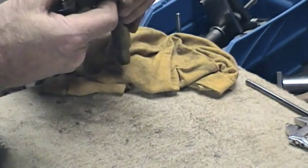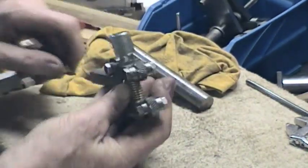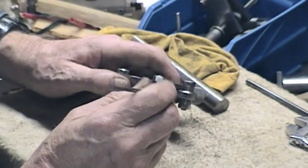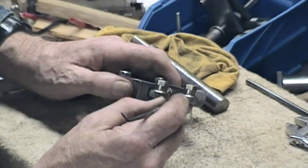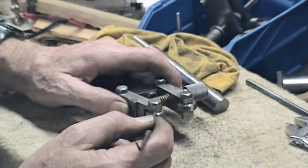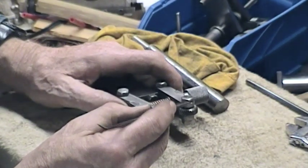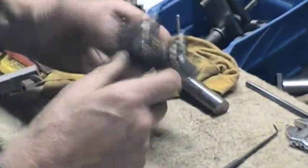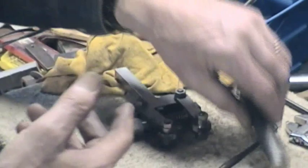So that would now be about the depth of the cutting phase. Now these wheels actually last for a long time when in use. These are bolts, so the wheels - which are hardened - are bearing on softer bolts. But we flood this with oil, plenty of oil, for this job. I don't usually knurl dry. And if the bolts wear out, they're replaced. These are actually just quarter BSF - another British thread - and I've got stacks of them. So the bolts are slightly sacrificial.